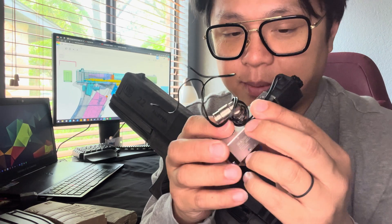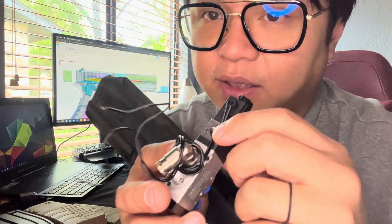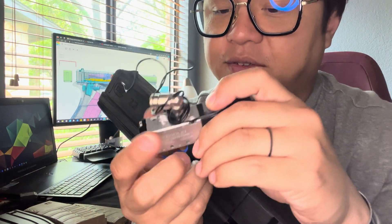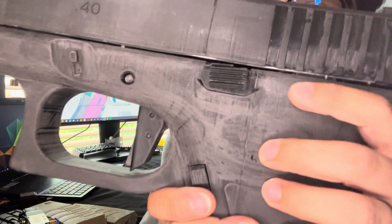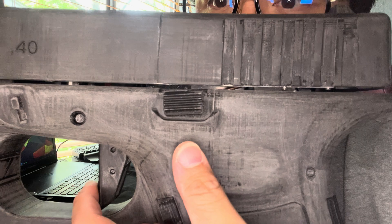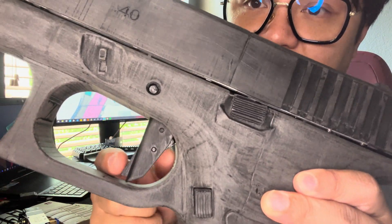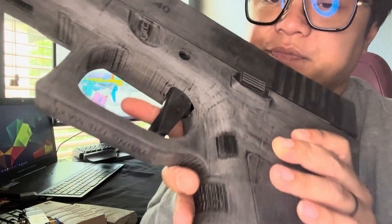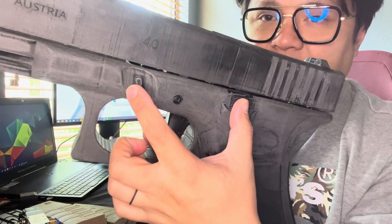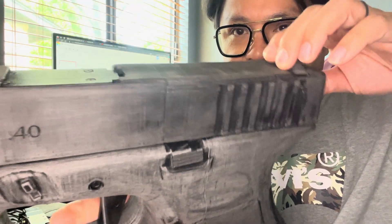This conveniently has a mechanical switch to actuate it. That's what I'm using on the internal — with that TIG rod that goes all the way to the trigger. The trigger has a trigger safety, so you can't pull the trigger that way — you have to push the trigger safety, then you can pull the trigger. Every time you pull the trigger, the F2 will fire and the solenoid valve will fire simultaneously, and it will reciprocate the slide every time.